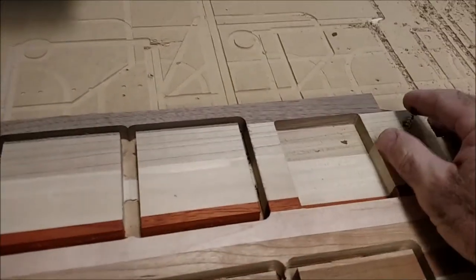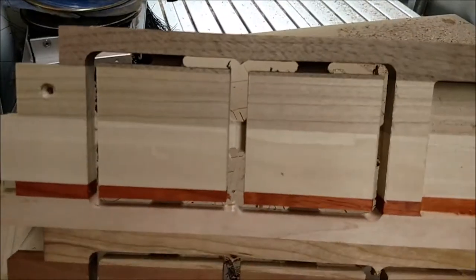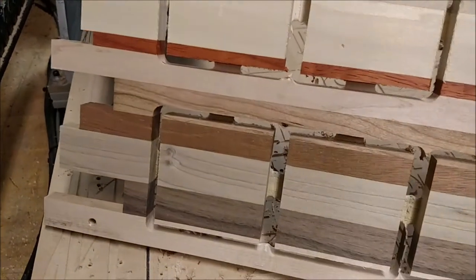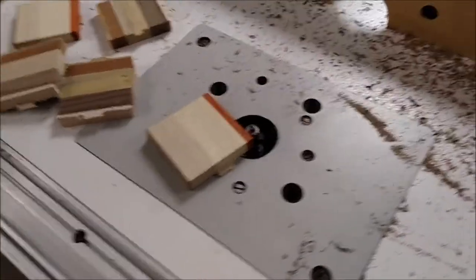There are my run parts — I have them screwed down to the tabletop. No tape for me. You can see the tabs in between the parts: there are the five coasters and then there's the pocket. I think I'll be able to break these out, but if not I'll use a chisel — coming from the back and pushing it through. Absolutely use a hold-down stick.